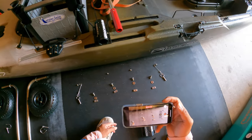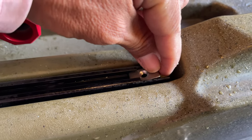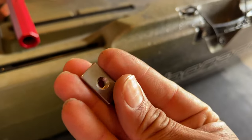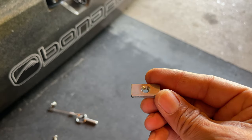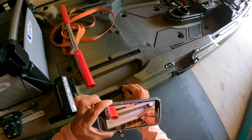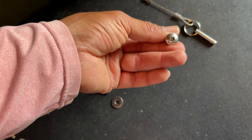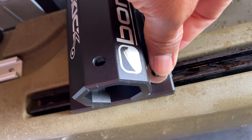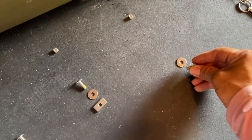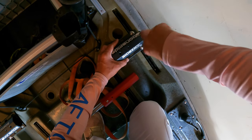Just for the sake of time, I'm going to show you how to install this portion. You'll take the gear tracks and slide them in right here, then take the other one and throw it in there as well. Pay attention to how that is beveled right there — you'll want the funnel portion facing upwards so that it's easier for the screw to actually go in. Line up these two outside holes, then take the Phillips screw and a washer, lay it down right there, and thread the Phillips screw on both sides. Just make it snug — you're not going to want to tighten it down because we're going to do some adjusting later on. Repeat this for both sides.